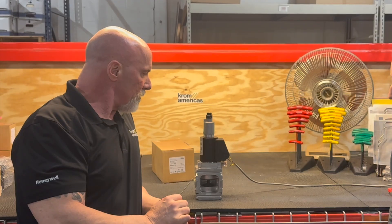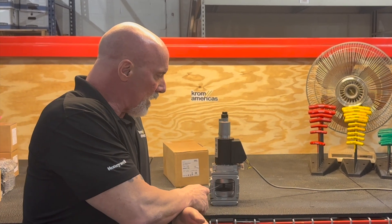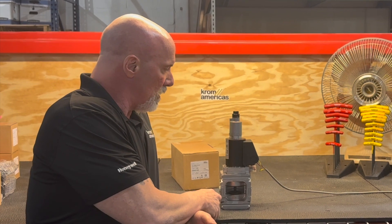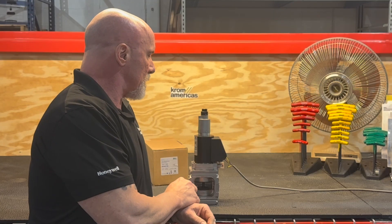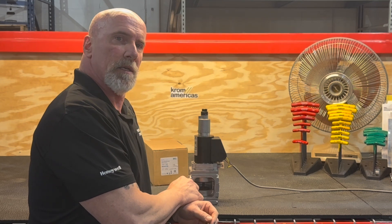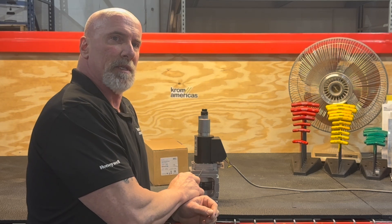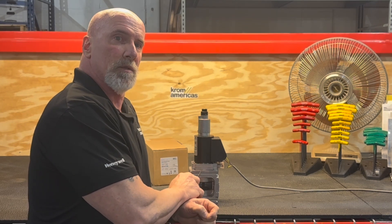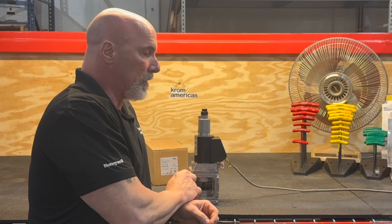There are three adjustments basically on these. You have one adjustment to get the valve off the seat and how fast you want it to come off the seat. You have an adjustment for how far you want it to open, and you have the last adjustment — which I think is the most important — which is the speed of how fast these things will open. We've been able to get this to go out to about 11 seconds slow and as fast as two seconds, which is pretty quick, almost as quick as a fast open valve, through the adjustment.